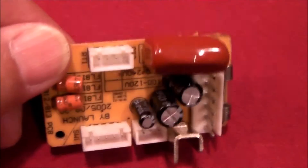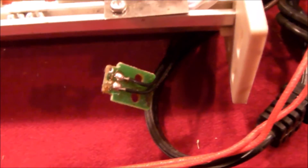With the circuit board out of the laminator, I initially thought I was going to have trouble with the thermal sensors — there's one there and another one here. As it turns out, those NTC thermistors appear to be good. As they heat up, the resistance decreases, and both of them seem to be working okay.